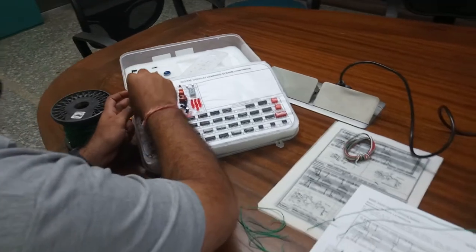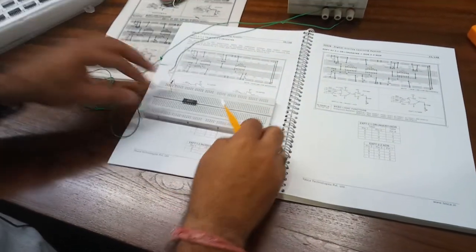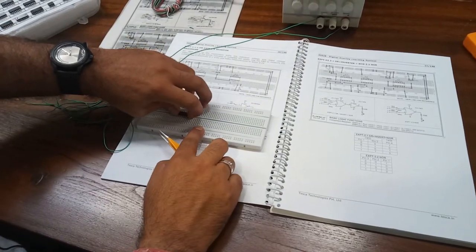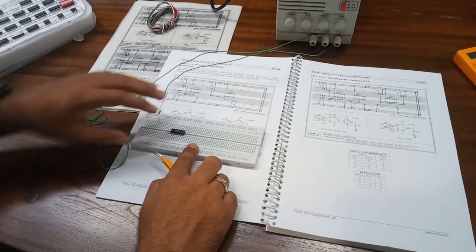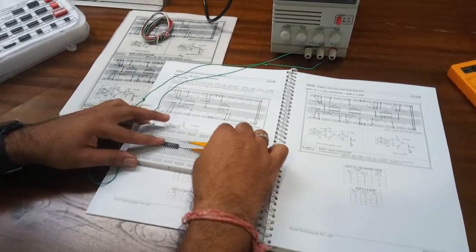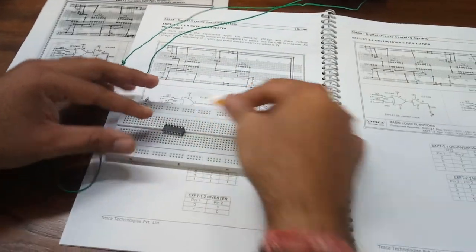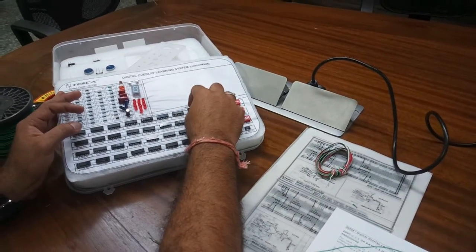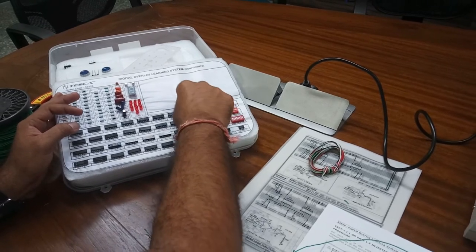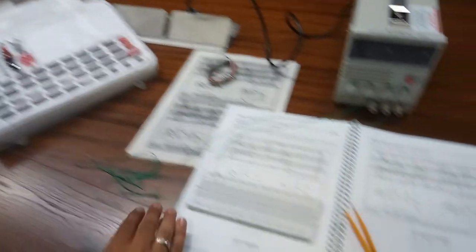Your components will be replaced properly. If in any case you find difficulty removing an IC — if the IC is very tightly fitted in the breadboard — use the tweezer to slightly push and lift the IC out, then place it back in its proper position so that your components are never misplaced.